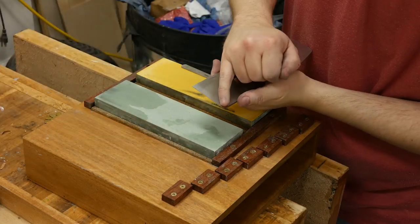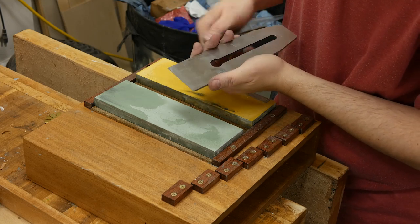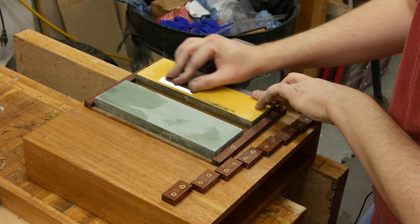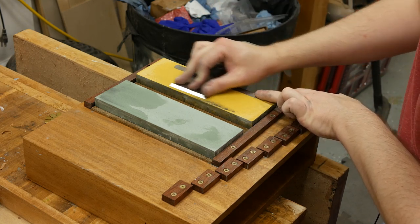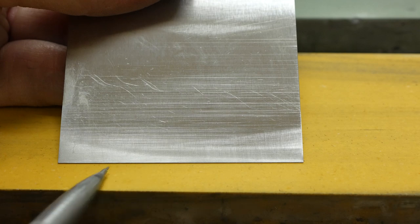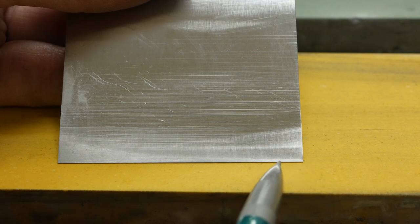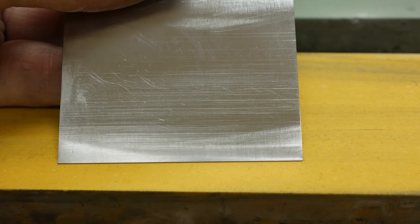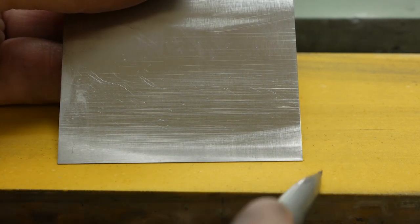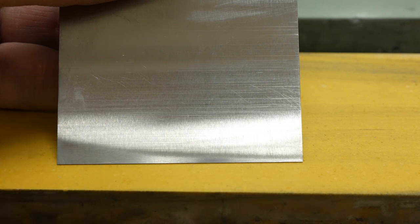Stop and take a look after a few strokes. What you're going for is the very leading edge starting to get a polish on it from your 1000 grit stone. After a few minutes you'll see it goes all the way across to the edge. That two-thirds-of-one-degree back bevel is all we need. It's all I do to flatten the back of plane irons, which saves a whole lot of time compared to flattening the back of chisels. Don't forget to then move on to the 8000 grit using the ruler trick again until you polish the back to a mirror-like surface.